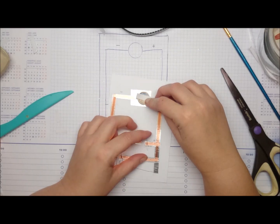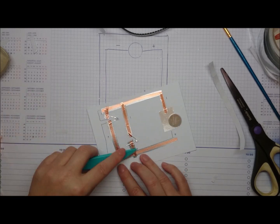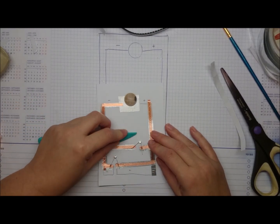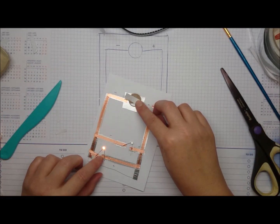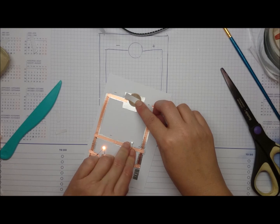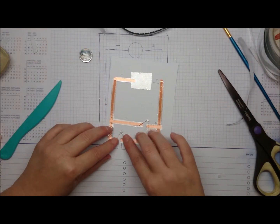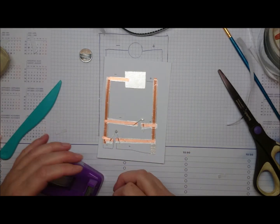See, with one battery they might work, but not very well, because this is 3.6 volts together and my battery is only 3. And if you remember from the other video, I showed you 1.5 volts wouldn't power these LEDs either, so I kind of forgot here. But I'll do 2 batteries, that's 6 volts, and then I can add another light.